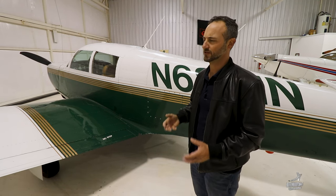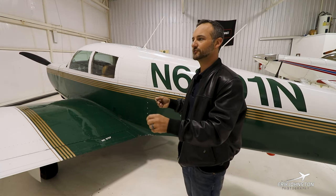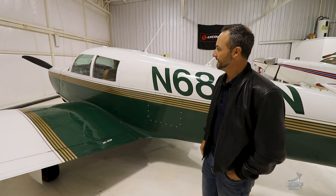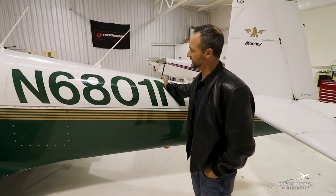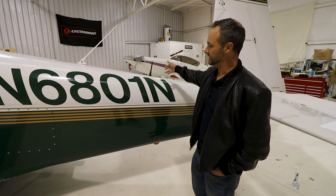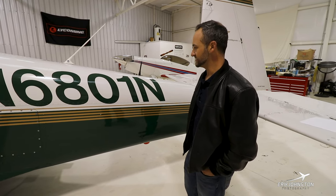It's been just an awesome performer for IFR, very stable. It has some pitch and roll trim — not much. As far as rolling to a heading, you're pretty much going to have to do that manually, but as far as holding a heading it does phenomenally. As we walk all the way back, we talked about the bulkheads and separators. We do have two static sources in the tail, and they actually connect in the middle. So you've got redundancy — if you get some blockage on one side, you've got that.